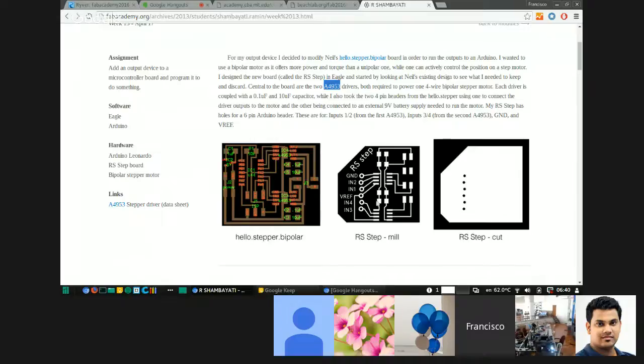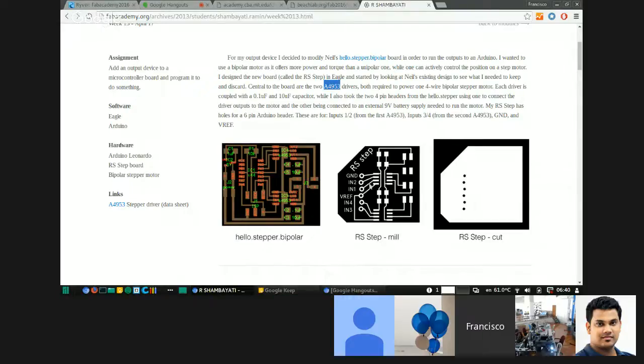Okay. Well, the first thing is we need to fabricate this board as compact as you can, modifying this design. The only thing is, ground here, and ground here and ground here. He forgot something? No, it's connecting ground here. Because he has the file here, you can modify the design in Eagle and fix the things that he is missing. I don't want you to drill a hole in here, just modify these paths and make them like this.